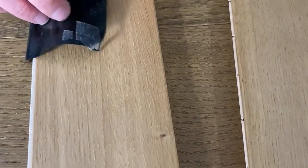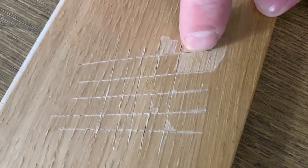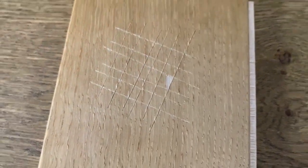This is essentially what you don't want when doing a scratch test. This shows straight away that there are contaminants in this wood that are going to stop the adhesion of the finish on the wood. That right there — that's bare wood. Not as much as this one, but this one is a hell of a lot worse. We'll try it again on the other end and see how we get on.